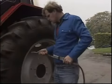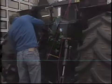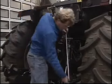Tire pressures must be equal on the same axle. The center line indicates that the tractor works at the same angle when ploughing in both directions. The actual tire pressure should be in accordance with the manufacturer's recommendations to provide both stability and traction. If the tires are inflated to different pressures, the tractor will lean over, as illustrated, further to one side than the other, affecting the plough's performance. The tire pressures have a direct bearing on the position of the tractor's rear linkage.